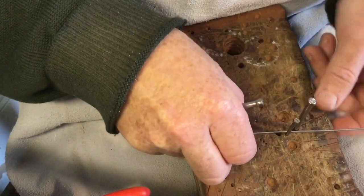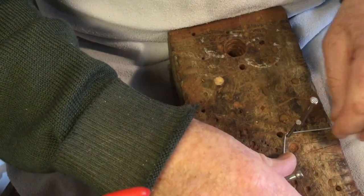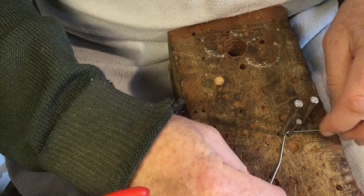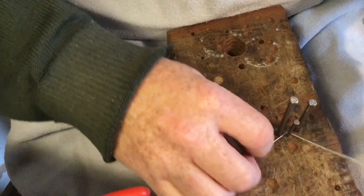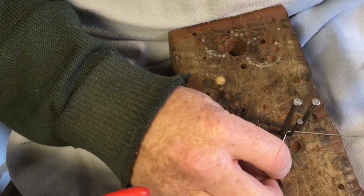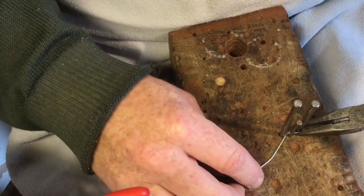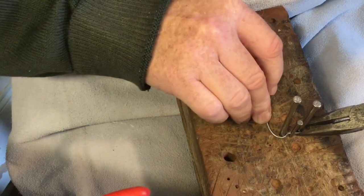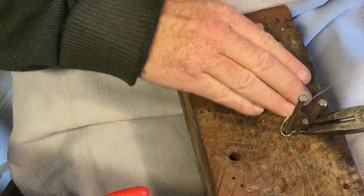Now we bend out the elbow of the eye and drop in our eye pin. With the music wire, because it wanted to spring back, you could put another stop pin over here. What I did was hold it in place tightly with a pair of pliers, then bring this wire around — you'll have to haul fairly hard with music wire. You could use thinner music wire than I've done, actually.